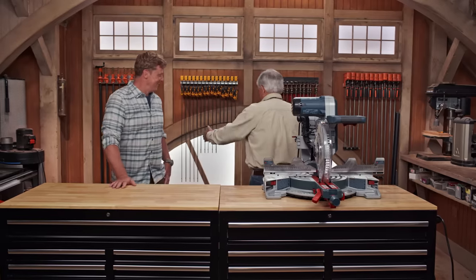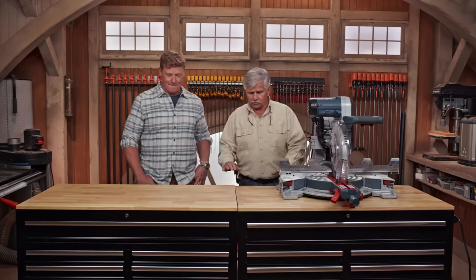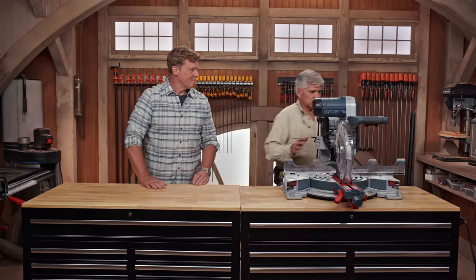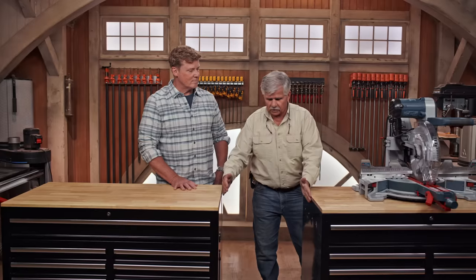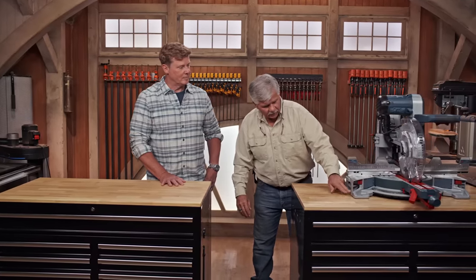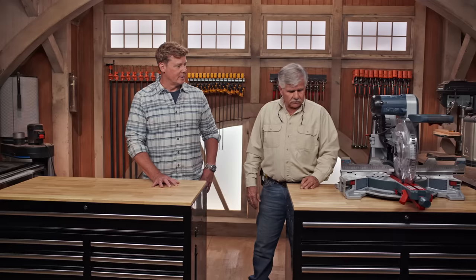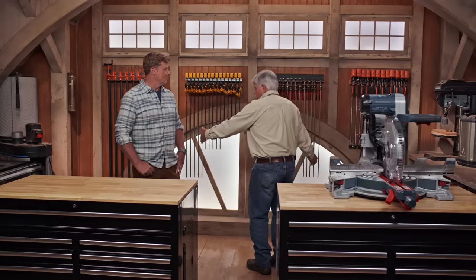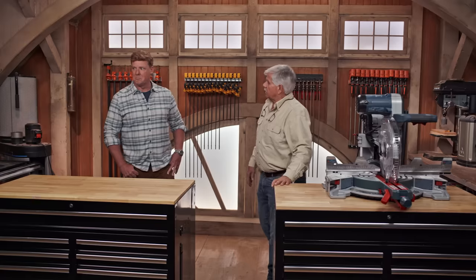What I want to do is make the cutoff station right back here. Use the whole length? All right, because all we have is our clamps here — we've got plenty of room. So I thought if we started with two off-the-shelf cabinets like these, lots of storage down below, lots of drawers, butcher block tops. Separate them enough so that we can get the width of the saw in between the cabinets and drop a shelf down. The height of the bed off of the tabletop, and everything will be at the same level — nice long workspace right here.